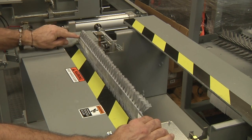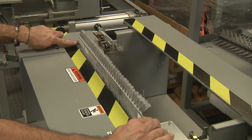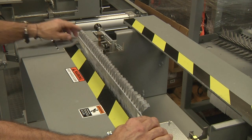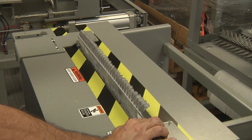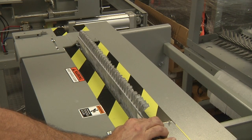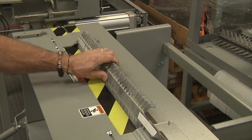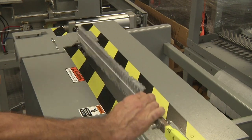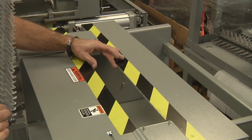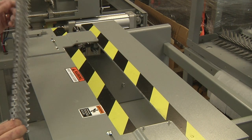My recommendation is that we remove this one finger, just like I mentioned earlier, because we have only a little amount hanging on to the edge. Basically, you close the jaw like you're doing the racking, then push the foot pedal down. There's a lever on the right-hand side — you pull the lever up and then release the pedal. As you can see, the gap is now shorter, and that's the way it's positioned for the unracking portion of the process.